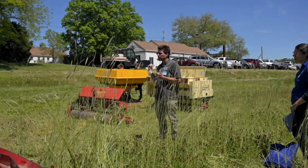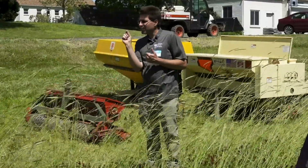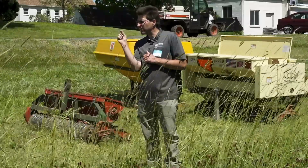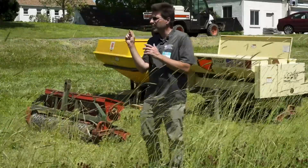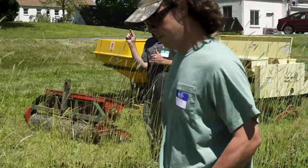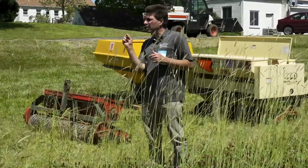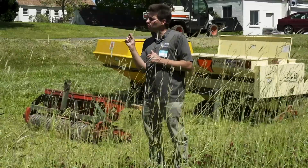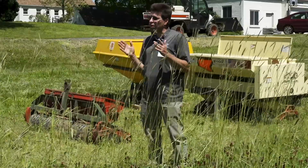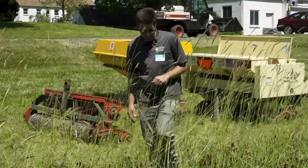Right. Because what you don't want to do is narrow down those flutes on that seeder so tiny that they're not going to stay perfectly in that position. If you bring those down too tiny, then as you're seeding, it might move on you, and you might end up getting nothing coming out, or you might get two or three times as much seed coming out. So you don't want to go that low on your adjustment. You want to bulk up your seed so you can go a little bit higher, at least a quarter inch of that flute out, so you don't have such a large percentage of that flute going in or out as you're driving, and it's moving just a little bit as you're seeding.